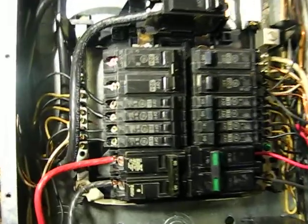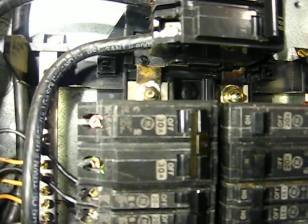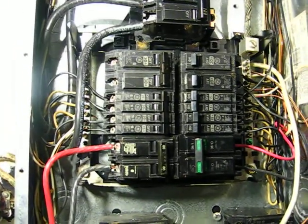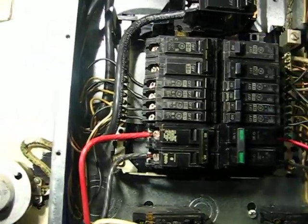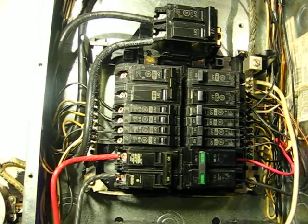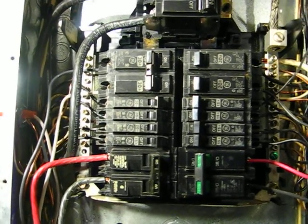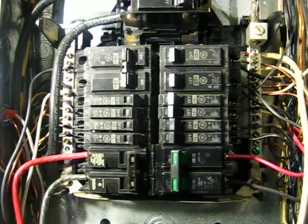As you see, we've got the new smaller breakers inside the panel, and now we have a double-pole 30-amp breaker that's going to serve our new water heater installation. There are the old ones right there — we're going to go ahead and leave them in the box in case there are any breaker failures. There are only two spots really left in this panel before they're going to have to do a sub-panel. This is the finished product with the new breakers — everything hooked up. We just need to get this wire to the water heater and we're done.